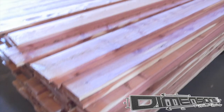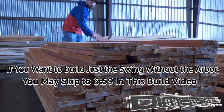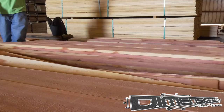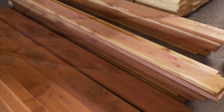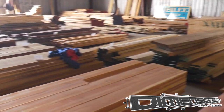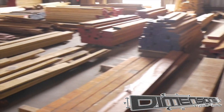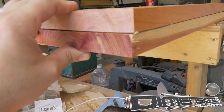So this is where the process begins in the lumber yard. We got some pretty eastern red cedar. This is a vital part of every single project I do. I typically go to the lumber yard with my cut list in hand. I know the length and width of all the boards I'll need and I begin to sift through the pile to see which pieces best fit my needs. Remember your lumber yard etiquette — make sure to put the stack back as you found it, then make your selection and take it to the house, unload it, and get to work in the shop.